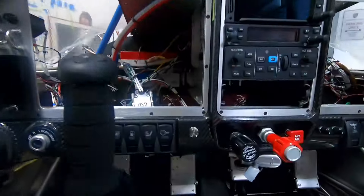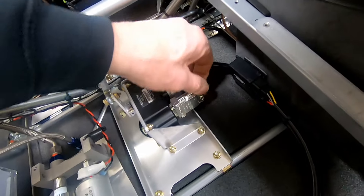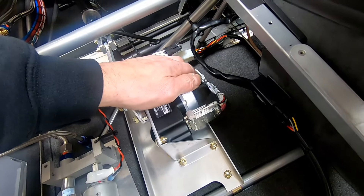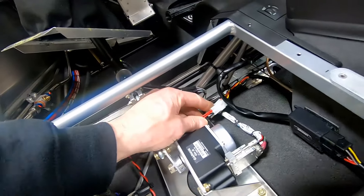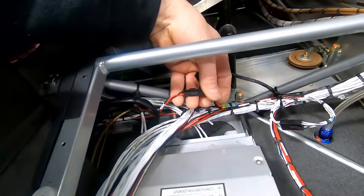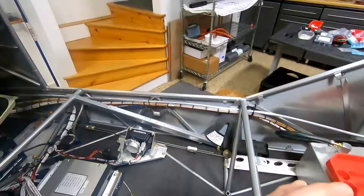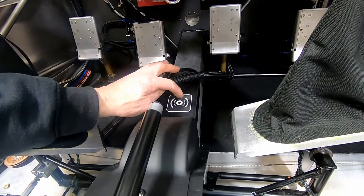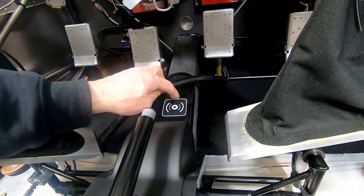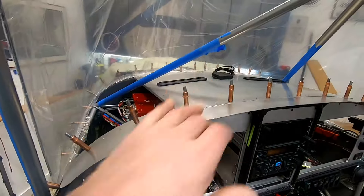So what else have I done since then? I finished wiring with George - I spliced in a couple of the trim wires per his instructions. I did these Molex plugs - these are for the heated seat modules - and did a little smaller Molex plugs for USB. One goes to the charger inside the center console and the other one is going to go for the wireless charger. I haven't quite finished that yet; I kind of put that project on hold.